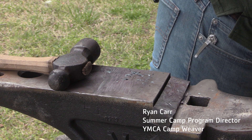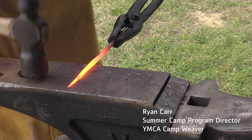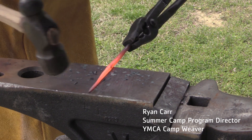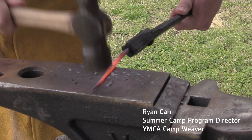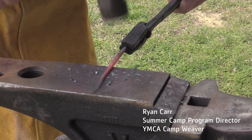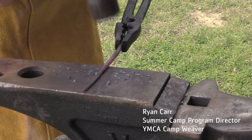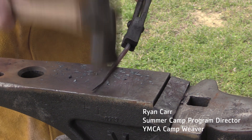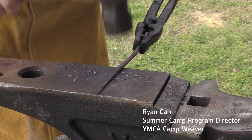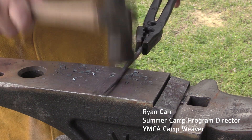The next thing I'm going to try to do — so I've created, as I was drawing it out, I turned the piece of round steel into roughly a square shape, but I don't want my end hook to end up being squared off. So what I'm going to do is go back and instead of hitting on the flat surfaces, I'm going to hit right on the edges, right on the corners. First I'll hit on one edge, then the two edges, and that'll turn it into an octagon, and then I'll keep hitting on the edges and basically round it out into a nice cylindrical cone shape.